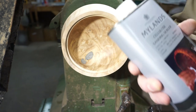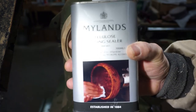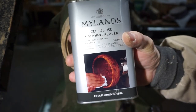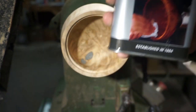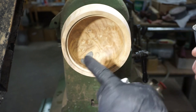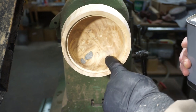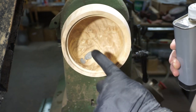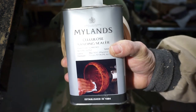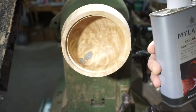Okay, so if you've been here on my channel for a while, you know that I use wood bowl finish by General Finishes. This is sanding sealer from Mylands. It's new to me. Now, this is poplar. And poplar tends to really yellow with the wood bowl finish or any urethane type finish like that. So I want to use the sanding sealer and see if that helps to stop that yellowing.